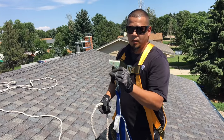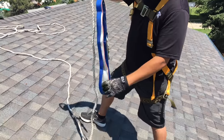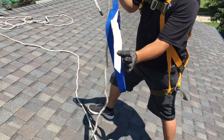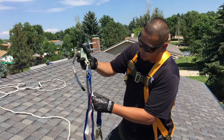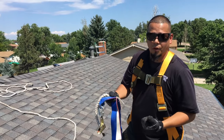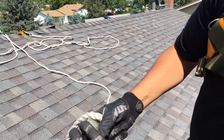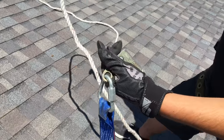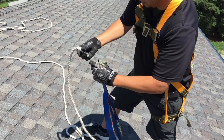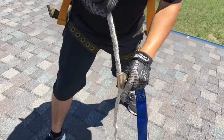What I'm holding here is the lanyard that gets hooked up on the back of the harness. It has two connection points, and the stitching between them is designed so that in the case of a fall, the weight will pull the stitching out — that reduces your speed a little bit so it's not a hard sudden stop. It has a marking that says 'up,' so you orient it correctly. There are teeth inside, so you open it up, get your rope through, and it locks in place.